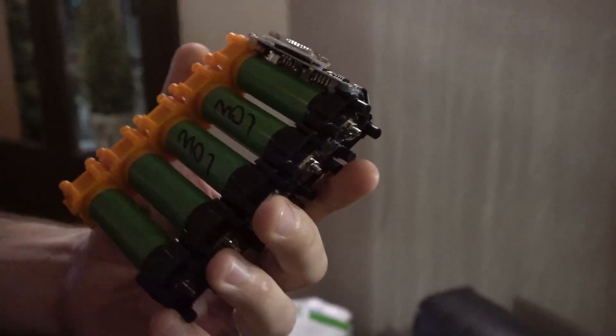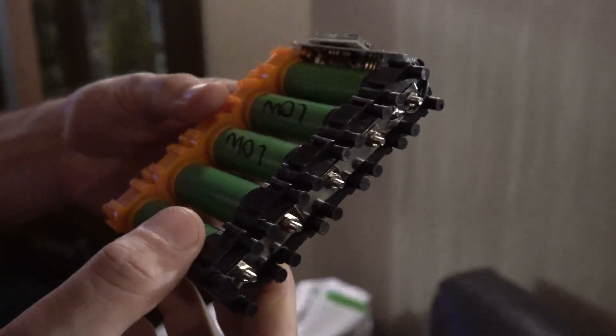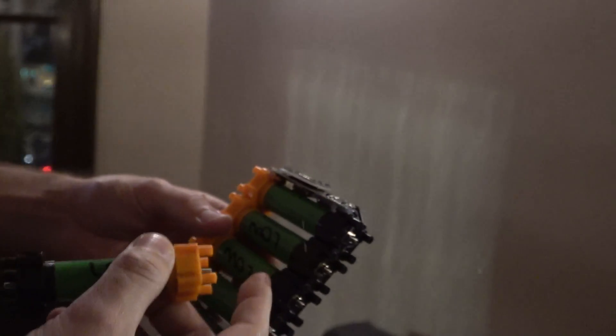Some people don't like the idea, but this is the 18650 cell. You just put end caps on it, which is the cell holder. You made a screw terminal so you don't have to do spot welding — you can just bolt it, remove it, and build battery packs like building Lego.